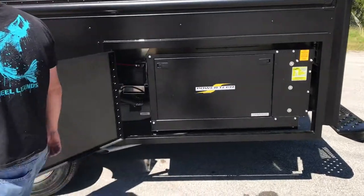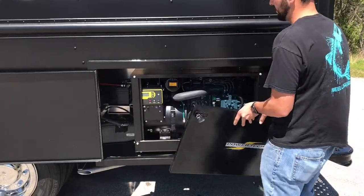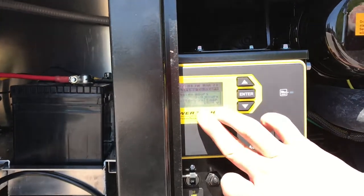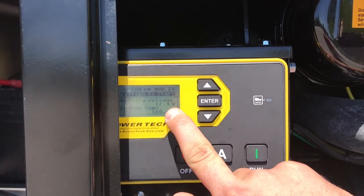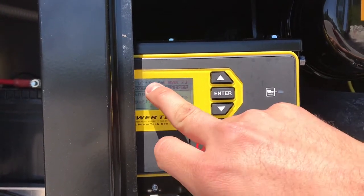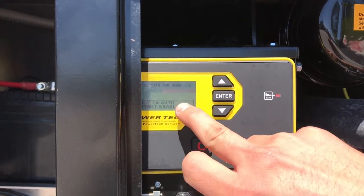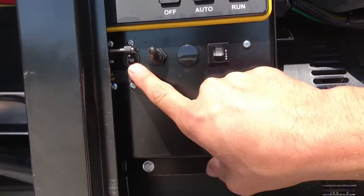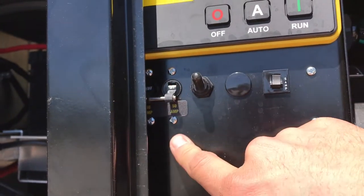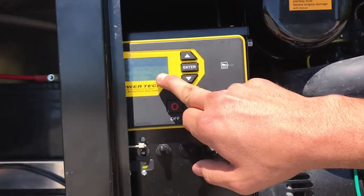Go ahead and open that up. Now that we have our battery power on, we can open our generator. We want to make sure this thing is in auto mode. Look down here at the control panel — it says 'waiting to start,' which means you can start this generator from inside the truck with the button. If you try from inside and it's not starting, come out here and check. If it doesn't say 'waiting to start,' it will not start from the remote panel inside. Make sure you push the auto button and ensure the breaker is in the on position. If you start your generator and turn your breakers on but have no power, check this breaker — if it's in the off position, you will not have power going to the truck. Put it up into the on position, make sure we're in auto mode, and we'll start this generator when we get inside.